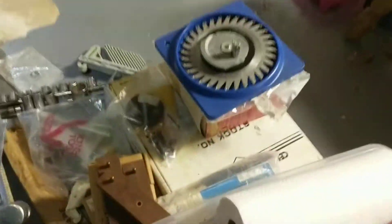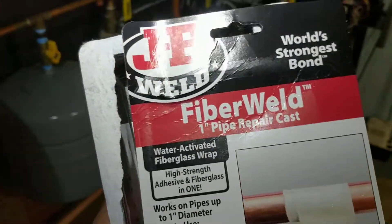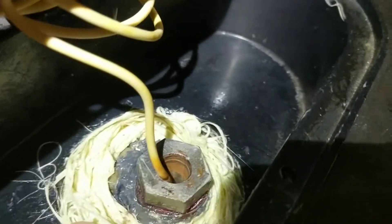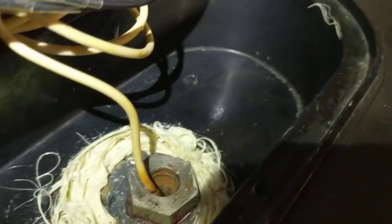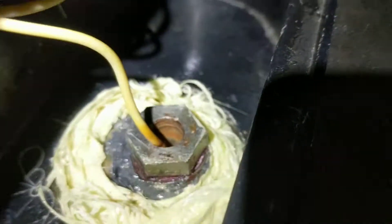I realized I wanted to give it a little more backing support. I remembered I had previously bought a pack of fiberglass tape — FiberWeld, also a JB Weld product. The idea is to wrap it around the fitting. Because of the dimensions it wasn't optimal, so I had to cut the two-inch wide tape in half to a one-inch strip, then wrapped it around as best I could. Where I couldn't wrap, I packed it in. I let it sit for an hour.